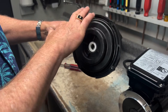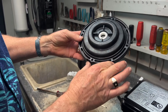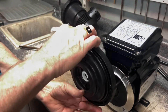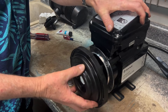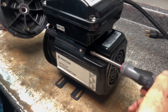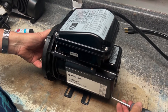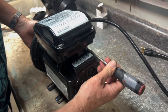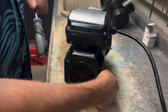Before we do, it's very important to note: when we look at this it's the same all the way around with the exception of down here — we've got two slots, and that is the bottom of the pump. Do not put this on the wrong way; make sure that faces down. Line it up with the screws and use the nut driver with the star bit. Start at the top, get the first one caught, then go to the bottom one, then the other side. Just get them started — we're not tightening yet until we get them all in.